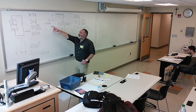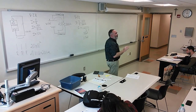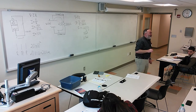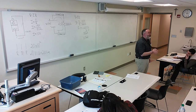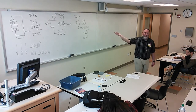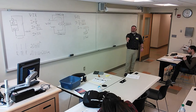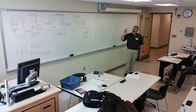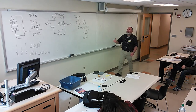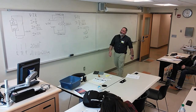So when we use this I for current, we're talking about positive current. And then you think, wait a minute, positive current. The protons aren't flowing, the electrons are flowing. However, in electronics, the agreement is, let's pretend as if there were little positive marbles flowing rather than negatives going the opposite direction. It's complete fiction, but then again, it's a picture, so everything's fiction, right? It's just a picture. I don't want you to be surprised when you see, not necessarily in our textbook for the class or our book for the deck, but on the web, where they say, here's the current flowing from positive to negative. This is what we use when we're talking about I for current.